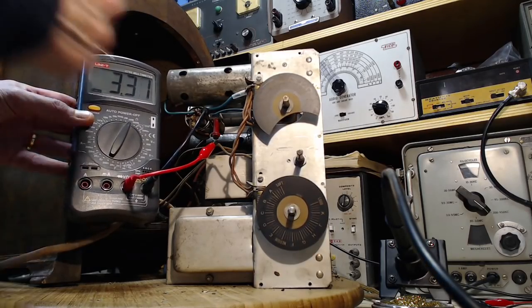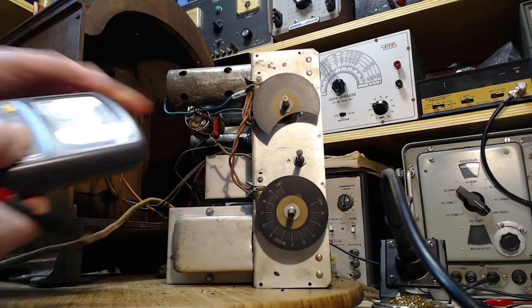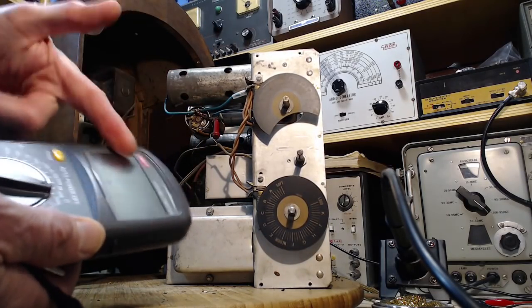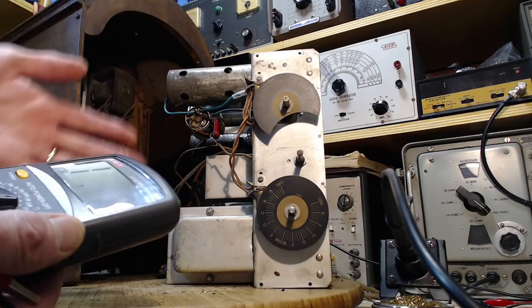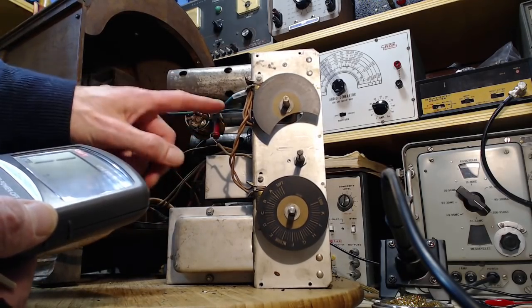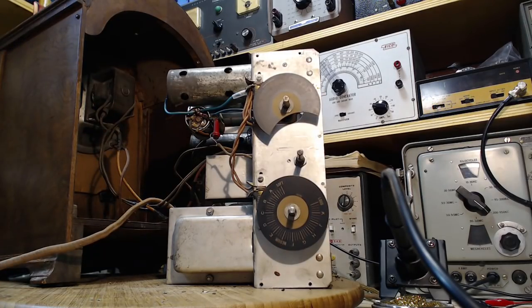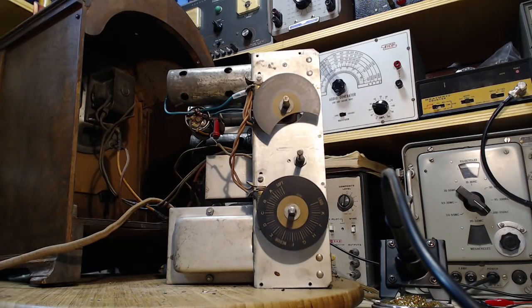Three. Body and dot. Okay, that's the way you read the code on these guys. Body is 2. So this should start with a 2. And instead it's starting with a 3. That's a whole 2 meg, 3 meg. That's an extra meg. That's too much. So I'm going to get rid of him. We'll put in what this schematic shows. A 2. Seems to me a 3 in this position is not so good.